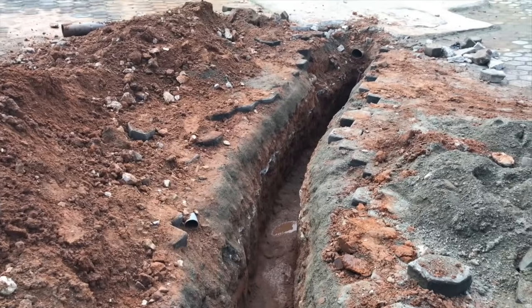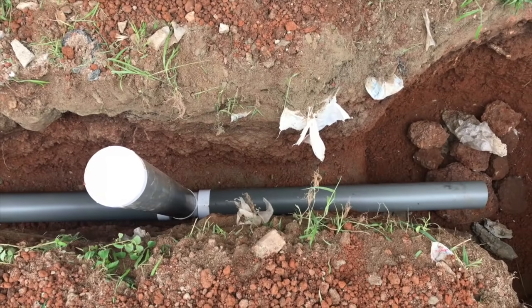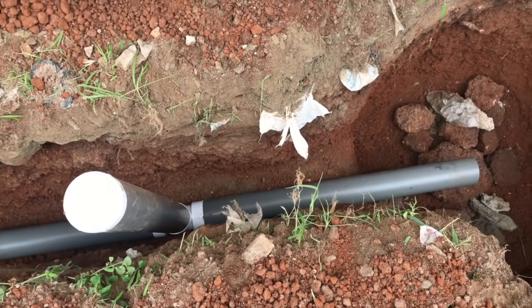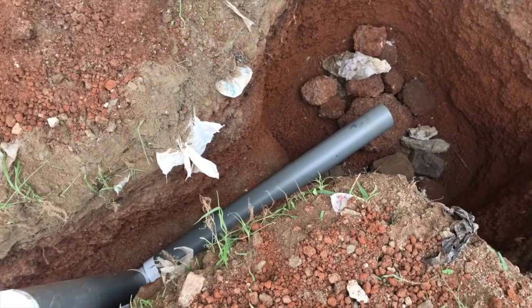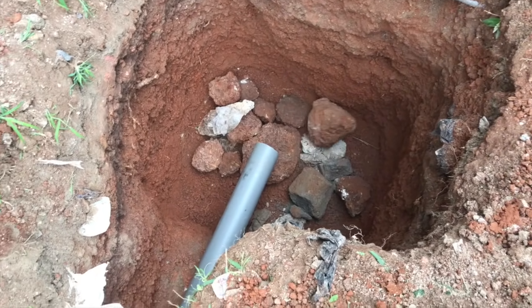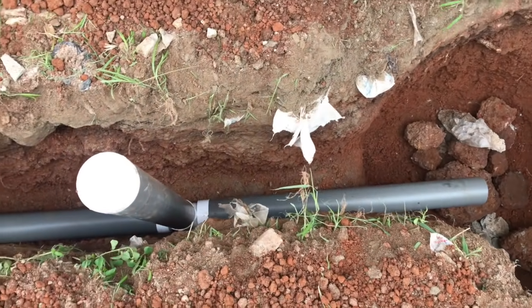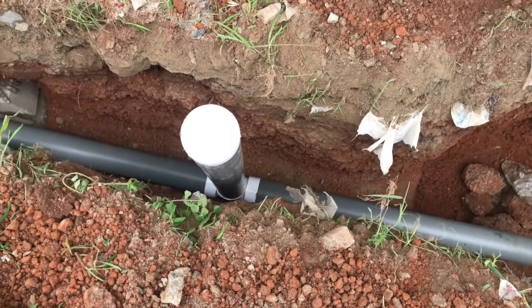Out of the back of the digester bed, you are required to dig a two to three feet long trench, wide enough to hold the leachate pipe, which is usually between three inches and four inches in diameter. It is preferable to use the four-inch pipe to allow for enough wastewater to pass through.